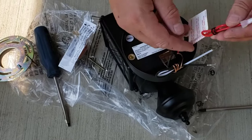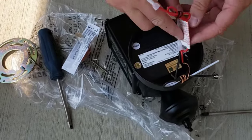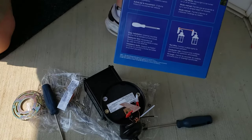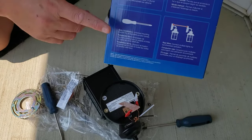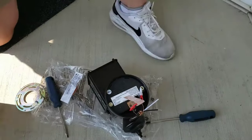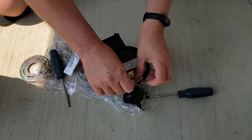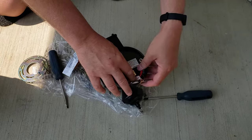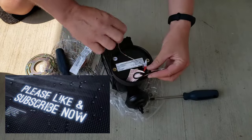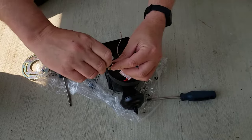You've got your ground which also acts as a tether wire. There's also an extra red wire — if you read the instructions, it says this wire is not for normal connection. The red wire allows you to connect lights so they're synchronized. I don't want that — I want each light to have its own independent motion detection. So for most people, this little wire just sits back and stays there for the rest of its life.